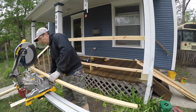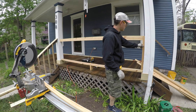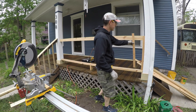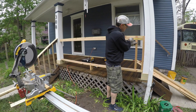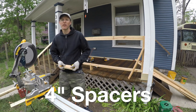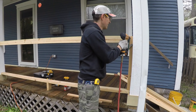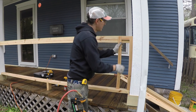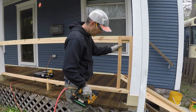It actually looked pretty good. This is a very simple railing — not super fancy, I wanted it minimal, affordable, and easy to build. As far as gap distance, code requires four inches or less, so I made some four-inch spacers and tacked the balusters in place on top. That's not the final attachment method, just a way to get them positioned quickly.